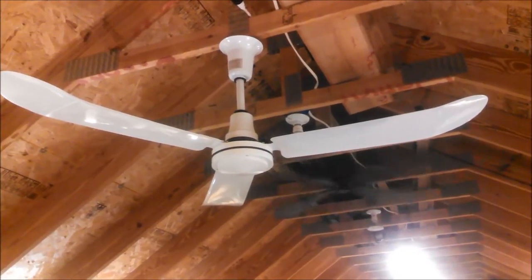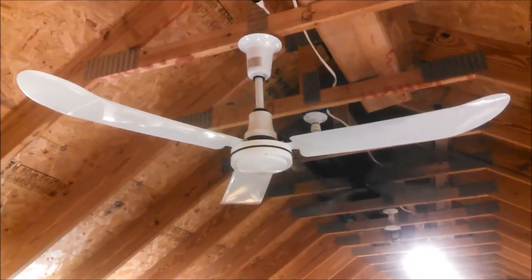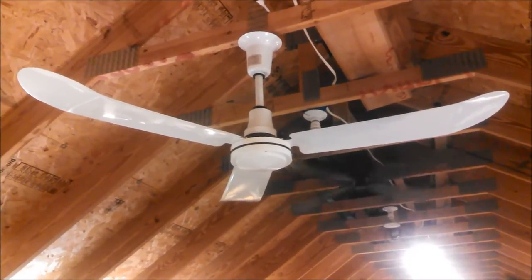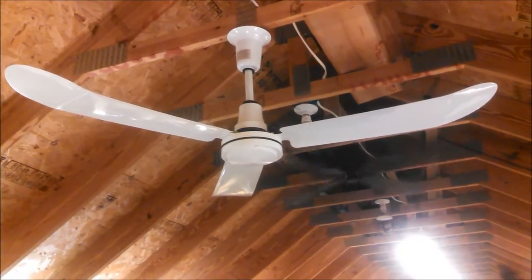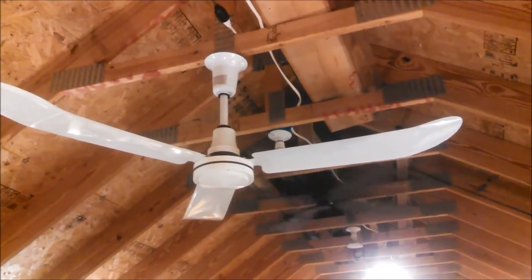But now, of course, it's not waterproof anymore because that scratched the paint a little bit. And more importantly, those are not stainless steel screws. I don't even know if they have stainless steel self-tapping screws. And so now, if you put it outside in water, it would probably rust.